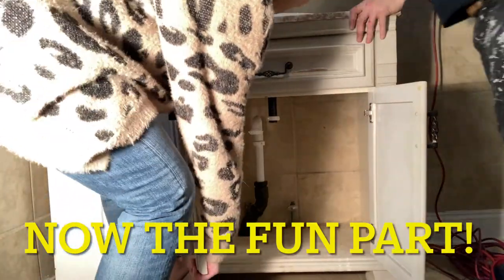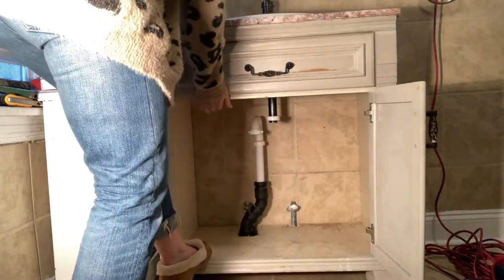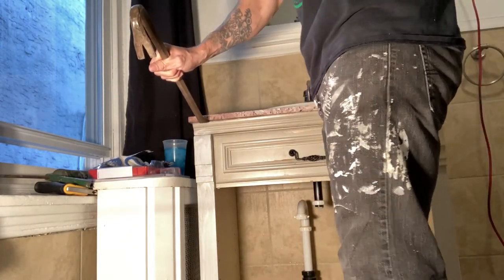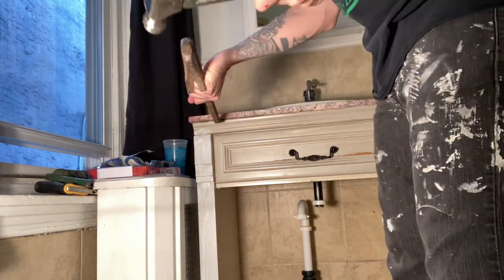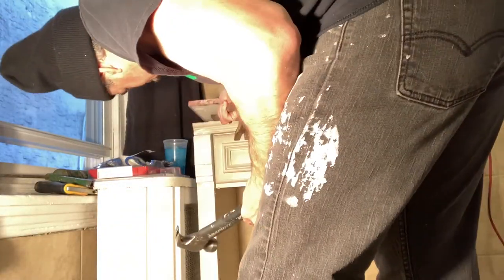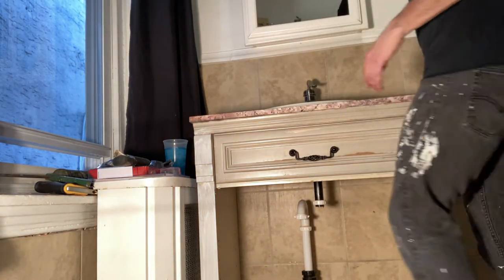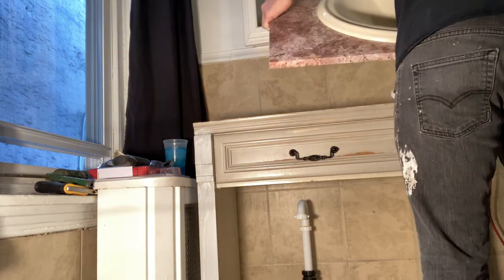I have to be honest, this part was definitely fun but it also served a purpose. One of the reasons we took the doors off is because I didn't know how hard this was going to be to remove from where it's located, so I thought that would give us a better grip and less obstruction. You take the sink off because the sink weighs quite a bit, and in doing that it makes your job a lot easier. Just take a pry bar, stick it underneath the sink, take a hammer, slam it in there, work your way around. You'll hear the silicone or whatever material they used to bond it start to break. I lifted it right off. If it's a really heavy sink top, make sure you get some help — otherwise just take it off and move it to the side.